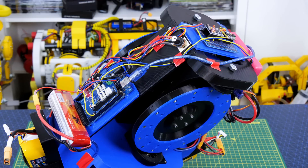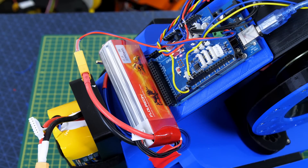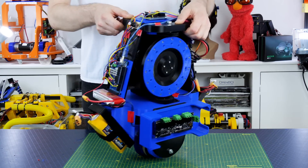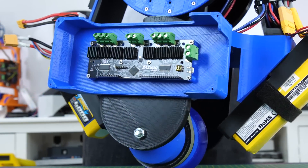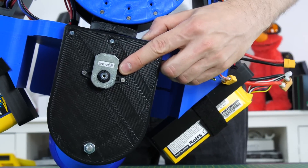I'm using pretty much the same electronics as the previous gyro balancers: an MPU-6050 inertial measurement unit partnered with its own Arduino Pro Mini, and a Mega 2560 which is responsible for all of the balancing and also has the Dynamixel shield from Robotis to drive the servo. There's a battery specifically to drive the servo at 11.1 volts, while the others run on 24 volts including the two VESCs powering the gyroscopes. An O-Drive 3.6 56-volt version is powering the main drive wheel, using an encoder mounted on the back of the motor shaft to accurately measure motor position and ensure the robot can balance properly.